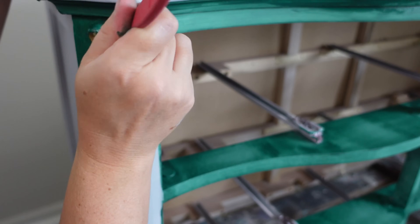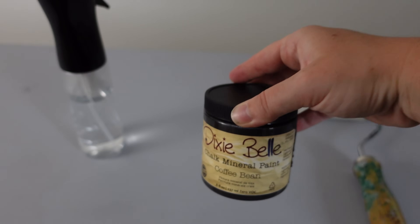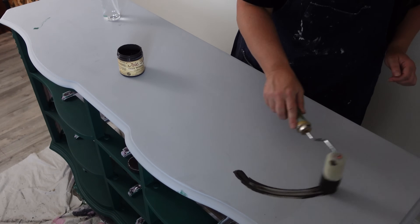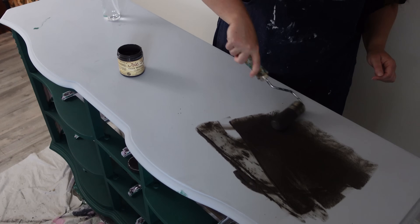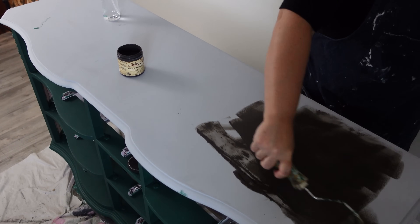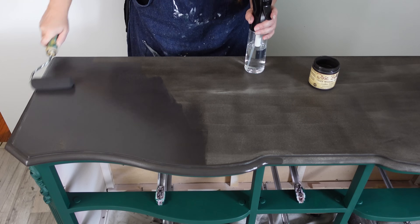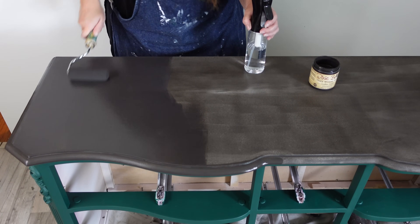For the top — ideally if it was a wood top and I was using Midnight Green, I would have gone with a dark walnut or maybe even an espresso. Look at how dark that green went — I wanted the top to be really, really rich. So I used Coffee Bean by Dixie Belle in their chalk mineral paint line. I can use my water mister to take out any brush strokes, and using the roller there were no brush strokes. My finish came out flawless because I did all that work in prepping and sanding.